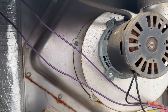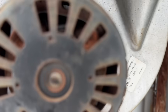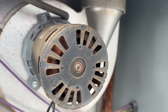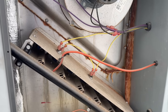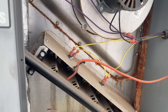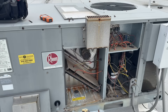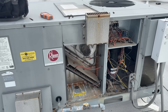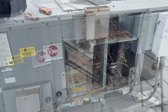We're going to have to replace that gasket. Not looking too healthy — and look at how charred the motor windings are on the draft assembly. Probably be a good idea to change that too. But then again, the landlord-tenant situation — we'll see what the landlord's going to pay for and what the tenant's going to pay for; they're probably not going to want to meet in the middle. So I guess by me pushing in that button, I bought them some more time.